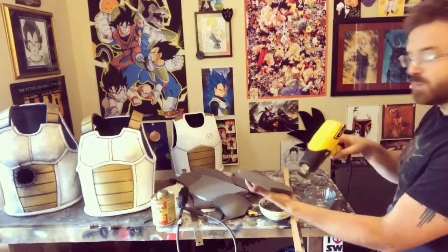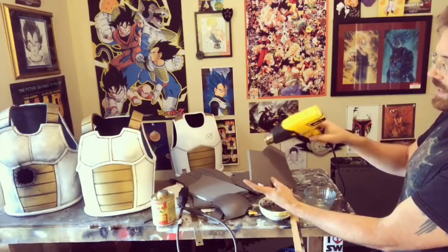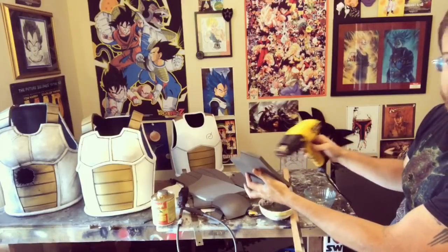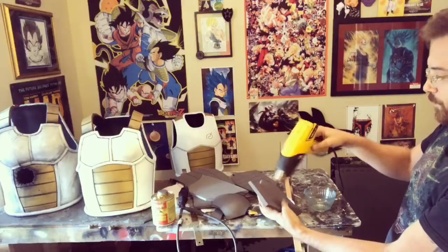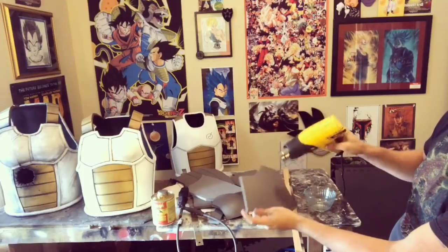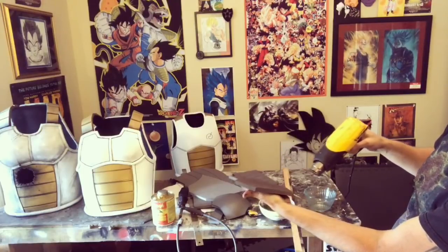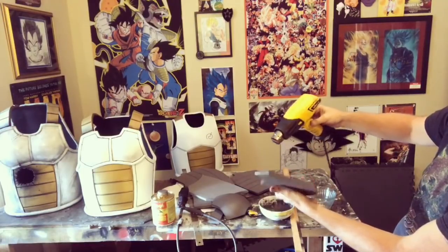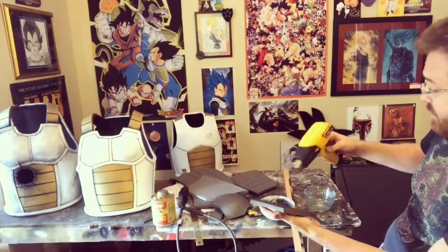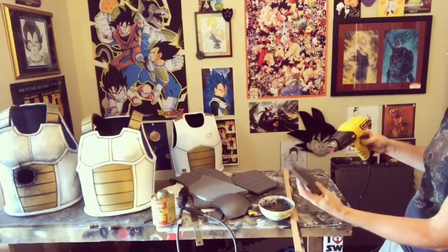All right, so we're gonna heat this one up and do the exact same thing. And it's super hot. Like I say, you gotta soak it in, my friend. You just don't wanna burn the outside of it. You gotta get it super hot, but not burning. If you start charring the outside, you're going too slow, you're too close. Keep it about 6 inches away, but move it back and forth in a way where it really wants to absorb that heat. It's gonna penetrate down into the center of that foam because you want the core to be flexible. And then it's actually gonna truly take that shape that you want. So I feel that it's getting flexible. I'm really happy with it.